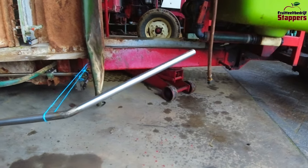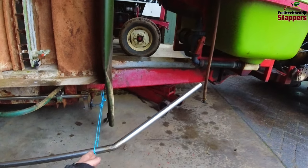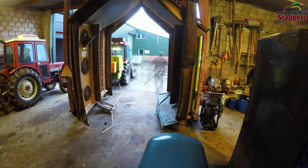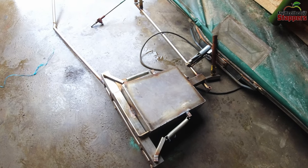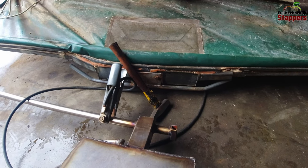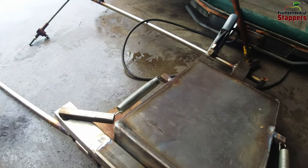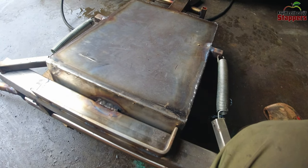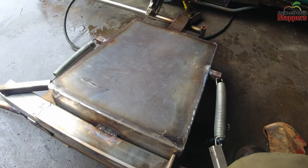I made a small mistake here — this part is sticking up too high, and if it's folded in this end could end up in the filter or in the tank, which we don't want. So I'm going to cut this one and aim it down more so it won't hit the tank. What I need now is a skid so this can run over the ground just like on the other side — it has a skid that touches the ground and lifts the whole thing up. This side also needs one otherwise it takes a real beating. I'm not going to make that out of stainless steel because that's going to be a wearing part, and it's easier to weld in normal steel. So let's make something.